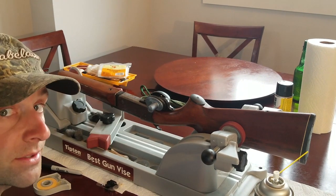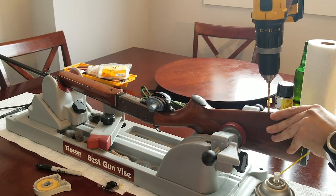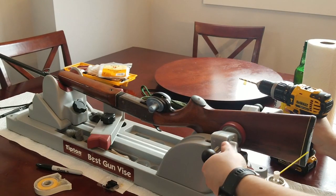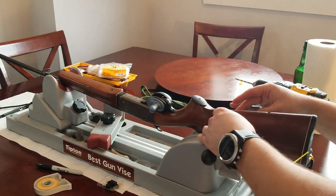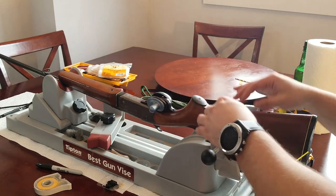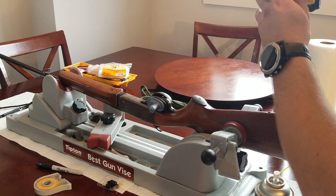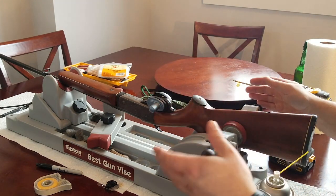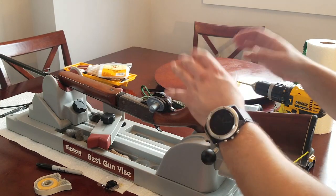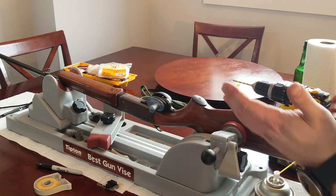So, now we drill. I make sure that it's perfectly vertical and that it's snug. I like this vise because it has padded rubber holders and it's snug — it's not going anywhere, it's not going to slide out. If you are going to use a homemade vise in your garage, at least take microfiber cloths or something soft to either side of it. You don't want to leave an indent from your vise into your stock.